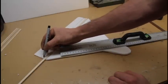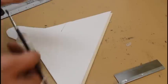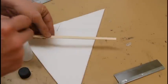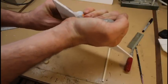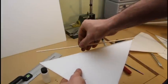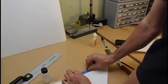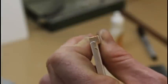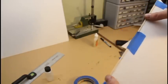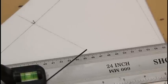I'm taking a piece of basswood here — a small piece, I think it's like three eighths by an eighth inch or even smaller maybe. This is going to be the motor support. It's very important that this is glued well. I'm using polyurethane glue. I'm using a brush and applying water to the wood — it's very important that you do that. I'm gluing on the backside of the foam, one side flush to the edge. I'm securing it with masking tape — I'm using 3M tape, but really any masking tape works pretty well.